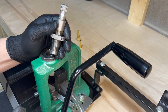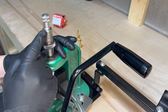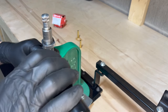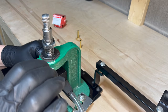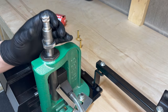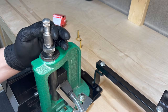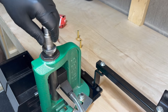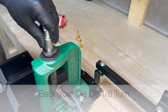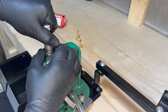I'm going to place the die into the press with the bullet seating plug all the way out. I put my shell into the shell holder, run it up to the top of the stroke, and run the die down until I touch the case mouth. Once I feel resistance, I back it off about a half turn and lock the locking ring. This setting will not crimp — all we're doing now is bullet seating.